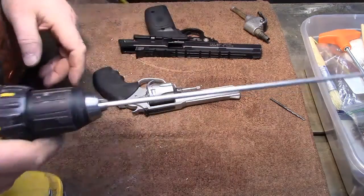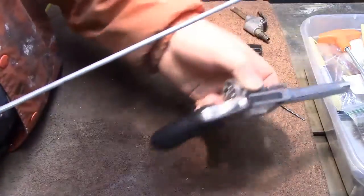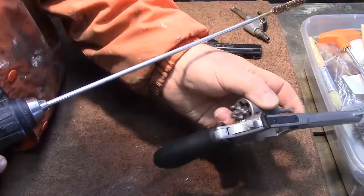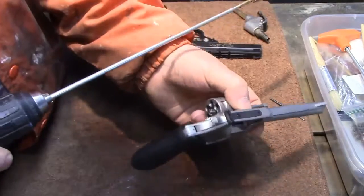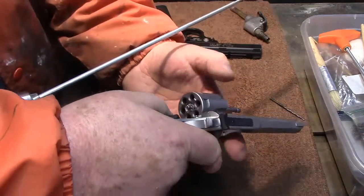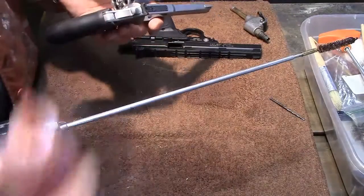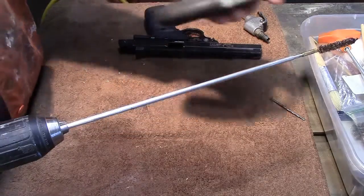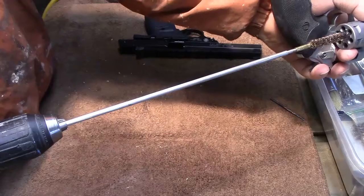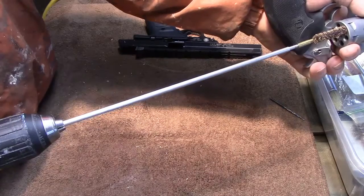In this case, what I'm doing is using a larger brush on a smaller chamber. This is the Charter Arms .22 — this is the one I'm having problems with trying to get the rounds out once the chamber or cylinder gets warm. The first six rounds it's not bad, but after that you've got a fight to get them out. So what I'm going to do is put some oil on there and force this brush into the chambers and drill them out, to see if I can kind of hone them out a little bit — almost like doing a ring job on a motor.